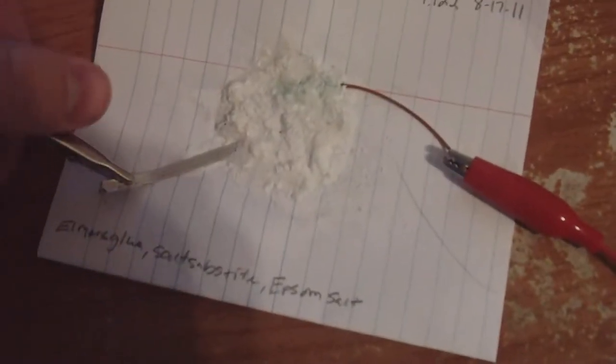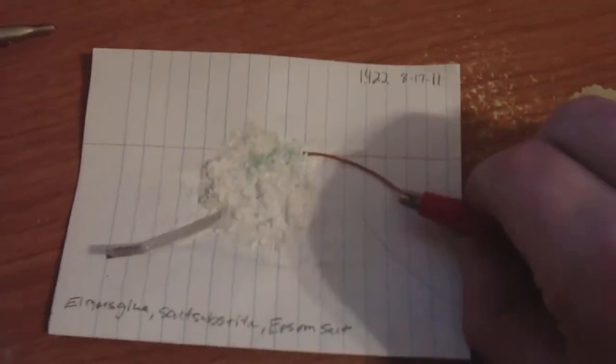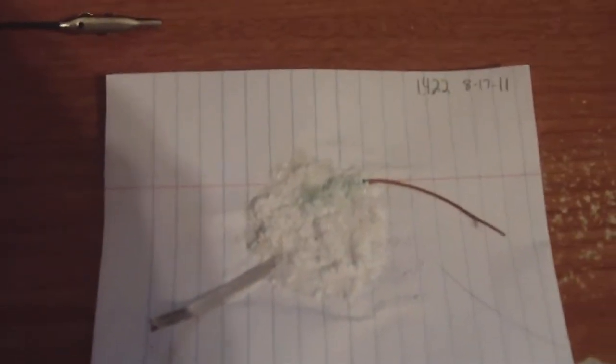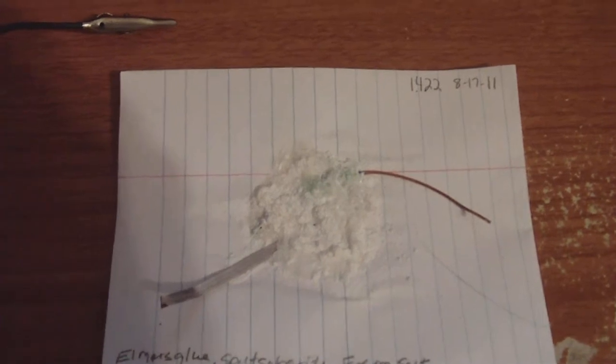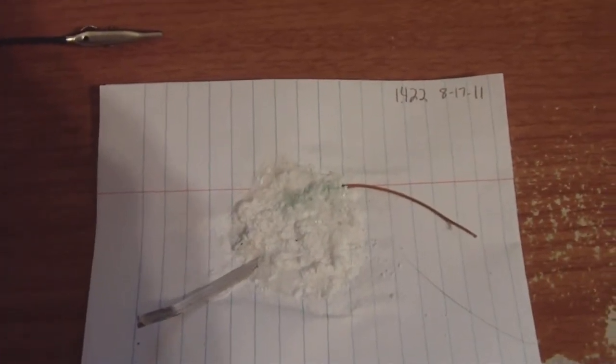Don't add any more water to it — water will corrode it. You'll end up with some oxidized metal. And don't think that magnesium builds up an oxide layer. It really doesn't when it's in water. It just hollows out the magnesium. And the bigger the metal you use, the longer it takes for that corrosion to appear.